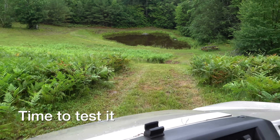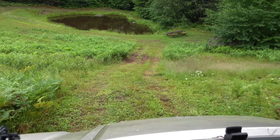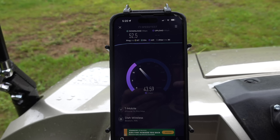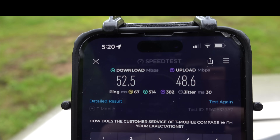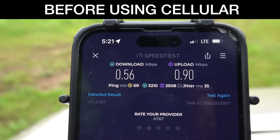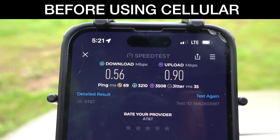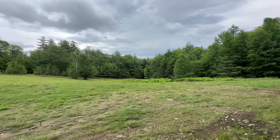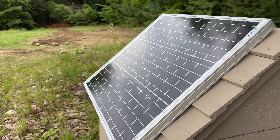To really test this out, I drove about another hundred feet away from my newly built station and got about 58 megabits down and almost 48 megabits up. That's an amazing result considering I'm now about 700 feet away from my garage. When you use mesh based access points the benefits are even greater, because I could add additional stations — whether powered by solar or plugged in — and they would continue to extend my signal, covering an almost unlimited area. If you want to live in a rural place, you've got to learn how to do things differently, and this little solar powered system is working beautifully. Feel free to comment below — let me know what you would do differently or if you might consider using a setup like this yourself.